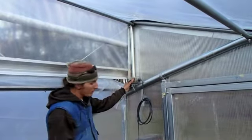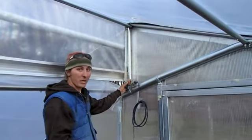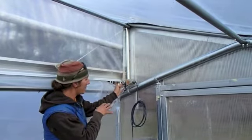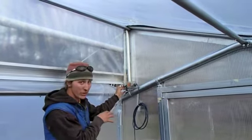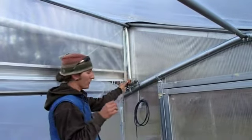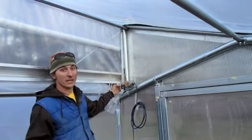As you're setting it up, you want to test it, make sure that your top limit is set, and that it has its full range of motion. Then once you have the controller box set up, you want to slowly lower the curtain, make sure it gets into its roll lock position, and then stops automatically.